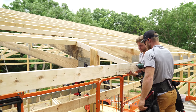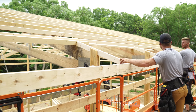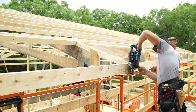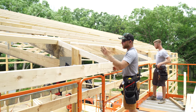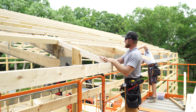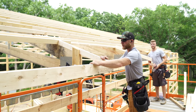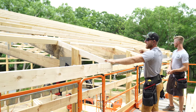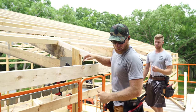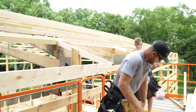We're working on the overhangs and figuring out where a tail can and can't be placed. This is where the start of the two-story porch is going to tie in to the upper roof section — we don't want the fascia to go through. The fascias will die in and be at the same level both on the porch and the main structure, but the valley is going to go up. We want to keep this space open, which is why it's going to look a little bit weird for right now.